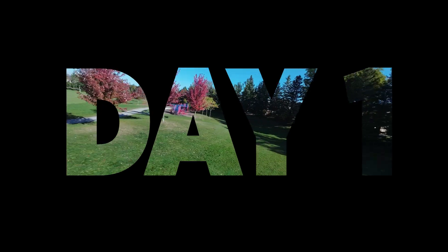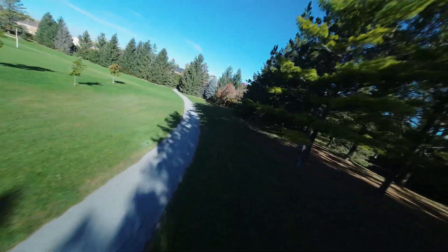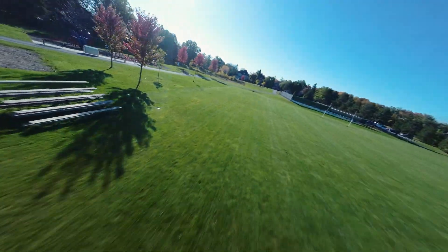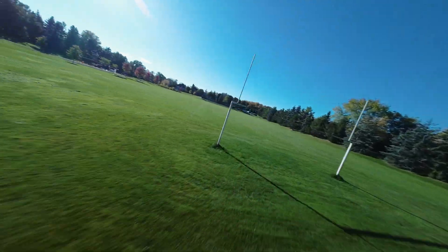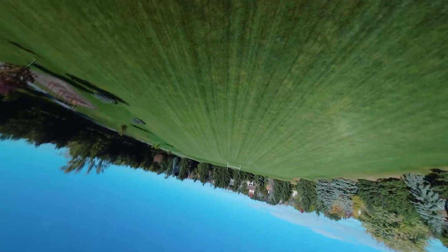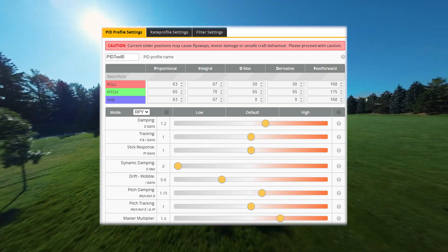The flight footage you're looking at is the raw 4K 60fps footage from either the goggles or the air unit onboard, without any stabilization — no DJI stabilization and no software stabilization. This is raw footage with a little bit of color correction. I found the JIN F-25 flew very nicely. As advertised, there was no frame or prop in view on both the goggle view and the air unit view. This is very important because the FOV between those two is different, but both had no frame or props. The quad flew super smooth, was quite stable, and even the full throttle punch out was great for a quad of this size and weight, very comparable to my lighter and larger three inch quad from Quadmilla.